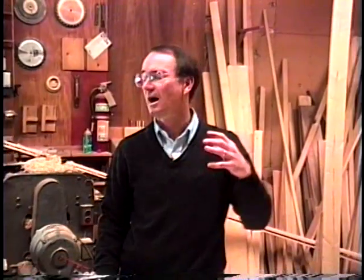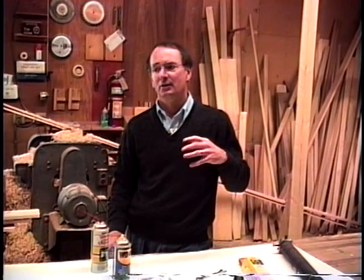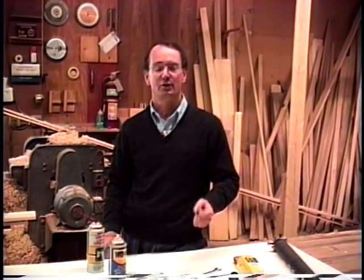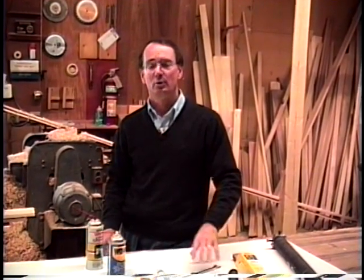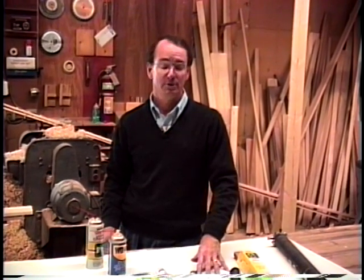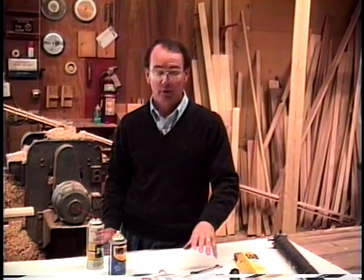And the oil that they use many times is a heavy oil, almost like a car oil that you'd put into your car. And if you think about it, if you go out to your car in the morning that's been outside and it's minus 10 degrees or it's 5 degrees, turning that car over in the morning, the battery, it cranks, it just doesn't want to turn. That oil's gotten so heavy. That's the same thing that happens in your automatic door openers. People will put a regular oil on that. They come out in the morning and the garage, it's 20 degrees, and that garage door opener starts to try to turn, and that oil is so hard that that opener just doesn't want to work properly. So we're going to use a special oil on those automatic openers and on the rollers also.